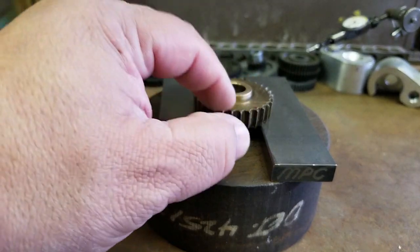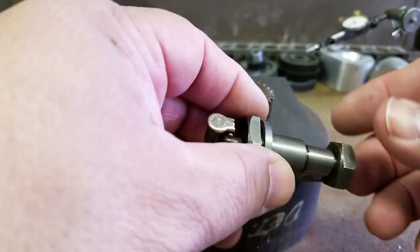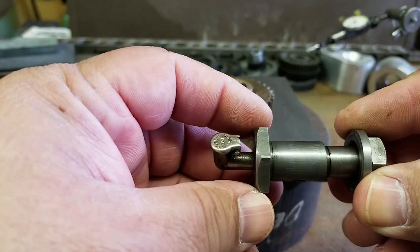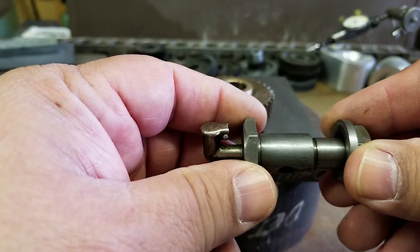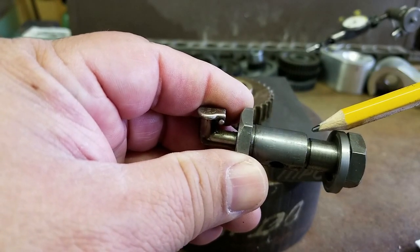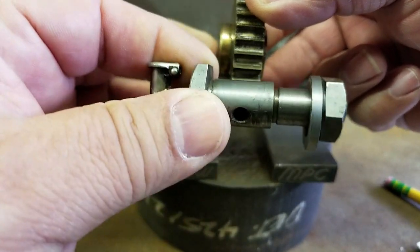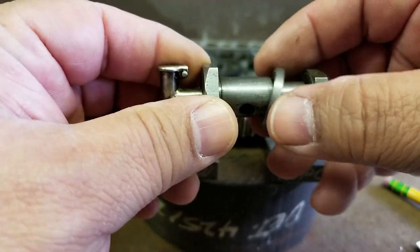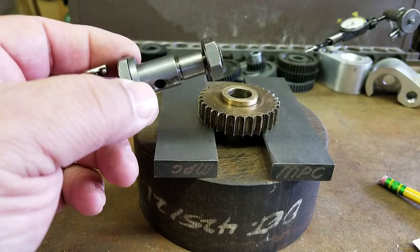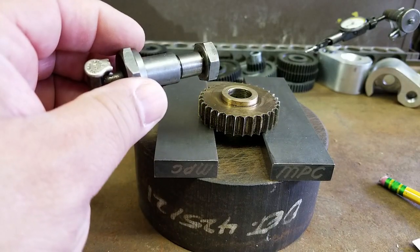First thing I have to do is measure the hub to the face of the gear. One thing I did realize — if you look at the stud that the gear rides on and mounts to the arm, you can see from this face to the edge of the shoulder — that's a dimension in there, and it does pertain to the hub faces. So even though it might not be precision to within tenths, it does have to be held to within thousandths. My guess would be anywhere a thou would be plenty of end play for this application.